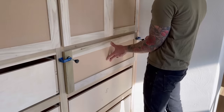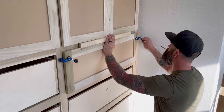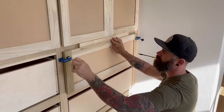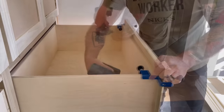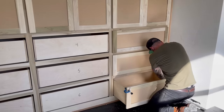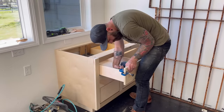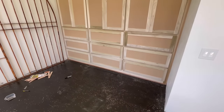All you have to do is get them positioned exactly where you want them and then open the drawer and screw your drawer face in place. To position these drawer faces, I cut a little spacer block that was the correct spacing to go in between all my drawers, and I butted the first drawer right up against my upper cabinet doors. Then a few screws later and boom — I have all my drawer faces installed.